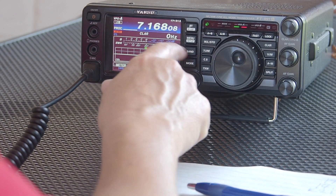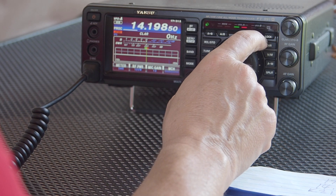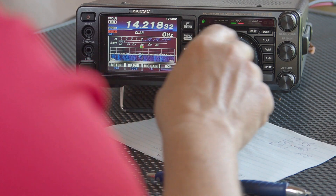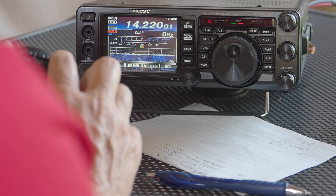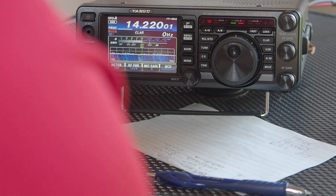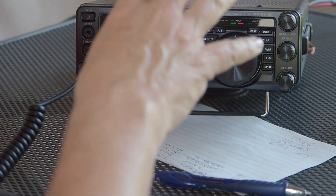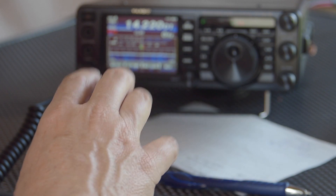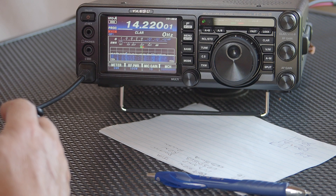Let's try to make a contact. Let's go back to the 20 meter band — that's where I've got the best chance. One thing I forgot to mention: when you push down on your microphone and hit the up button, it starts tuning your radio. What I forgot to mention is that the controller for the ATAS turns the power down to five watts for the tuning cycle and then turns it back up for the transmit cycle — back to whatever you had your radio set at.